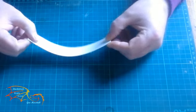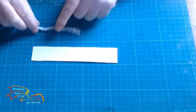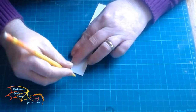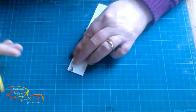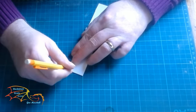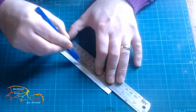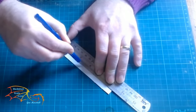I'm going to be putting in LED strip lights, and what I've got here is a plastic card and an LED strip light. All I'm doing is measuring out the width of the light so I can cut out a strip. I'm just placing it against the plastic card, making a little mark, then I'll cut out the length that I need by scoring the plastic until it's deep enough just to snap off the strip.